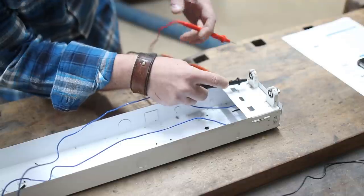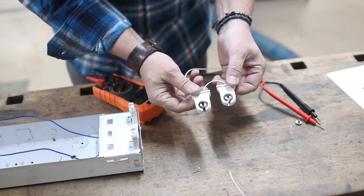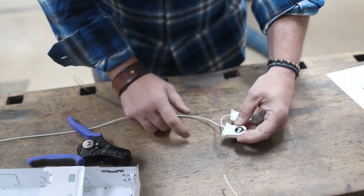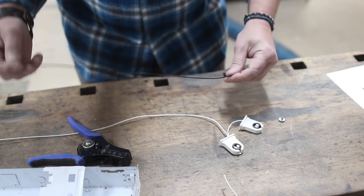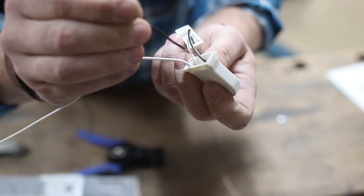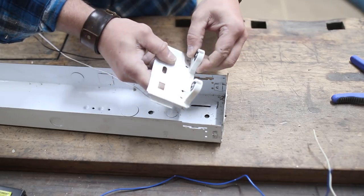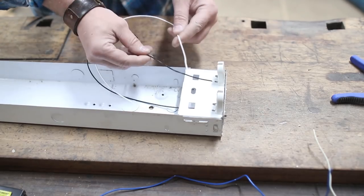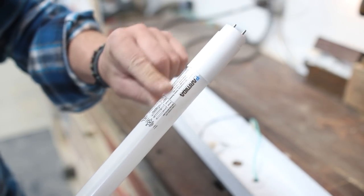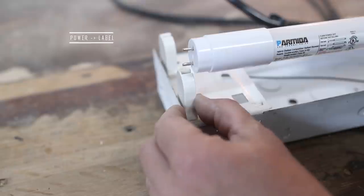If we get a tone, that means that they're shunted and we're going to have to replace them with a new set. Since the old ones are shunted, I got to replace them — I got these on Amazon for a couple of bucks, link in the description below. Since these already came with a neutral wire connected to both tombstones, all we have to do is just add our black power wire. First, I cut a short jumper wire and connect it between the two tombstones. Then I take the longer black wire and connect it right next to the black jumper wire — and that, my friends, is it. This is our single ended connection. The only thing left is to connect the power wires to a power source. When installing single-ended connections, you have to make sure that the side of the bulb with the label goes to the power side on the fixture — label on the bulb goes to the tombstone with the power on it.